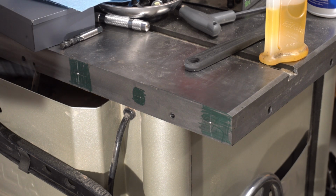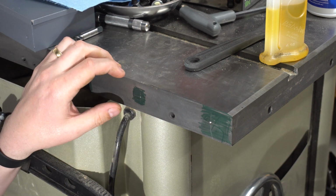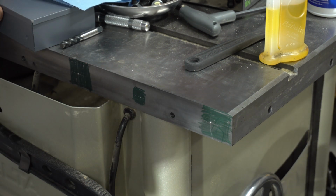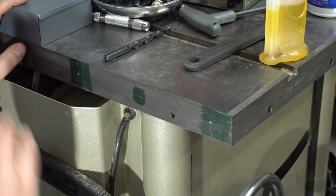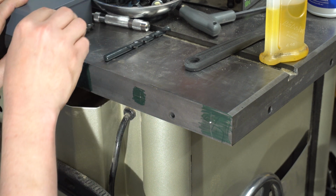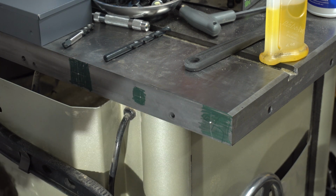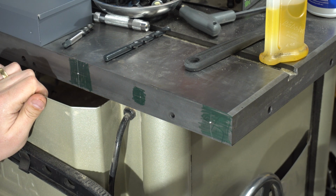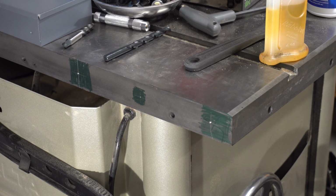So I did do some test holes on the other piece, the leaf that's getting put on here. I can't remember what size. I did 2 different sizes. Both were in between whatever Q is here. And ran the tap in there and had another bolt that was the same size as these. And the threads didn't feel very good, so hopefully this works. And then I drilled them out all the way, one size above 3/8. 25/64. And if you want that in thousands, Google it.